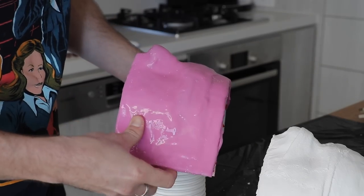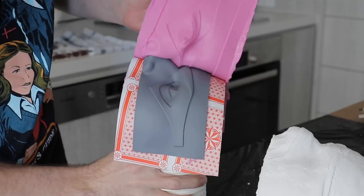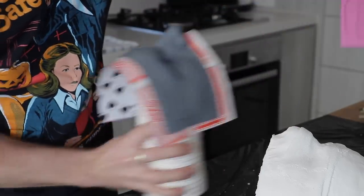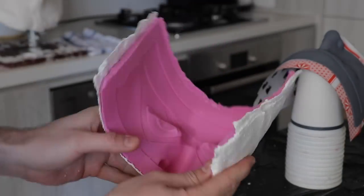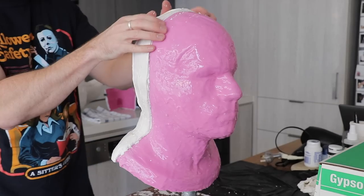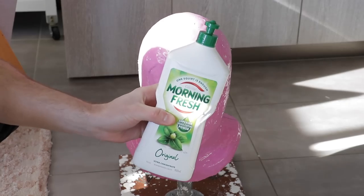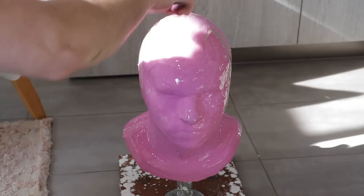I love this - it's so therapeutic when I'm peeling off silicone. But you really want to take your time because you don't want any parts to get caught and rip in certain details that will affect your casting. Peeling the silicone from the cowl was nerve-wracking, especially around the chin and the nose. Once you go over the chin and the nose it's smooth sailing. To help, I brush on some detergent.